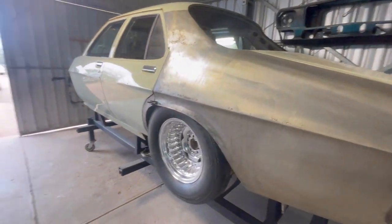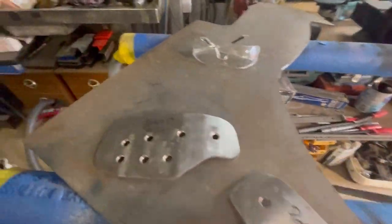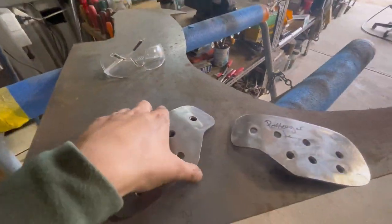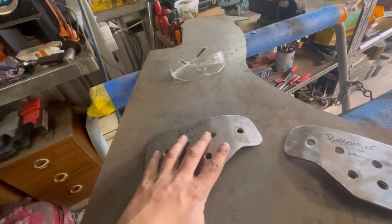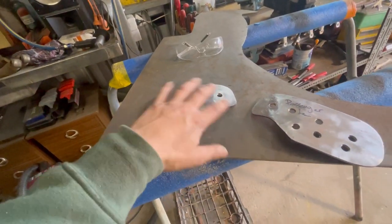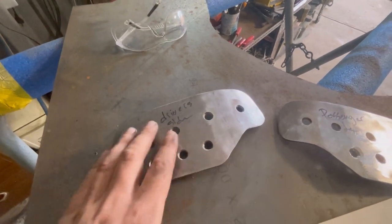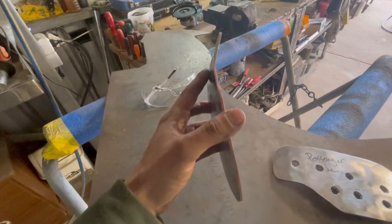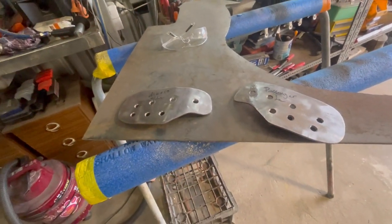I've made a start on some of the chassis reinforcement plates. The ones I'm going to fit first are these ones here, which will go at the front of the rail on the exterior. That's three mil plate, obviously rolled into shape or bashed into shape. I've tried to make them curve a little bit, but when they're clamped in place that'll be fine.